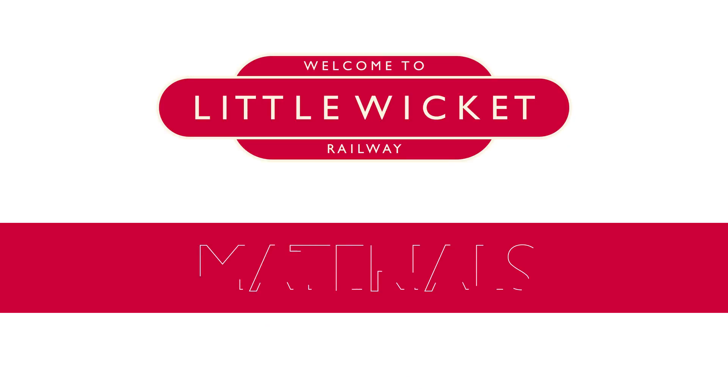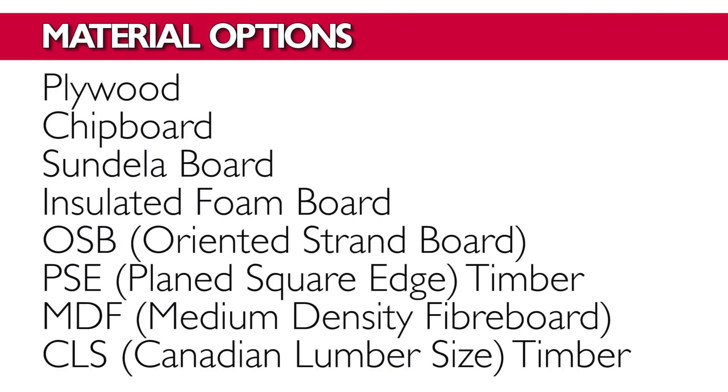Now let's talk materials. There are a few factors that will impact your choice of materials. The two biggest are likely to be the environment and the budget. With the environment — will it have to deal with temperature changes and moisture such as a garden shed, or will it be somewhere dry with stable temperature? With budget — plain square edge timber, already cut to size, might be easier to work with but it's likely to be expensive, whereas salvaged or recycled wood could be a lot cheaper or even free. Some materials are more expensive, others don't handle moisture well, some come in limited sizes, and some might not be easy to find in your local DIY shop. There isn't one size fits all and you need to do your homework.